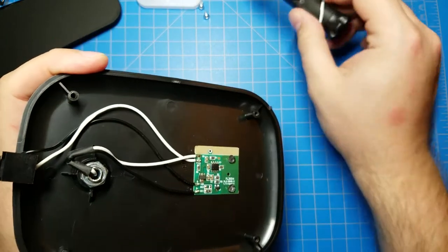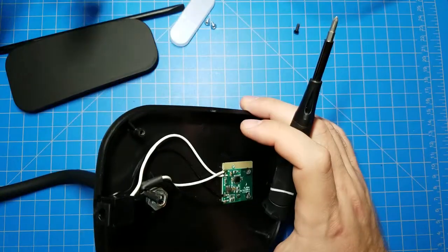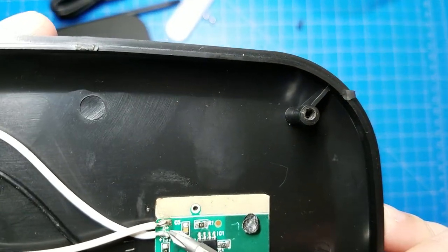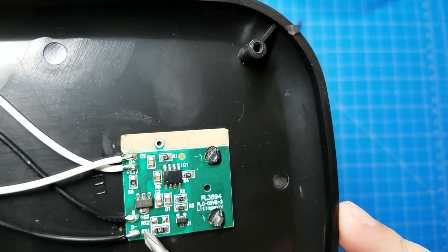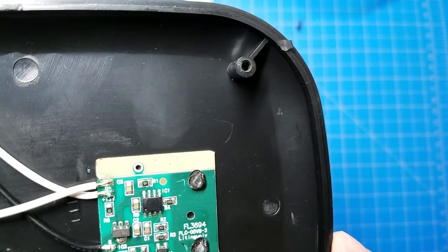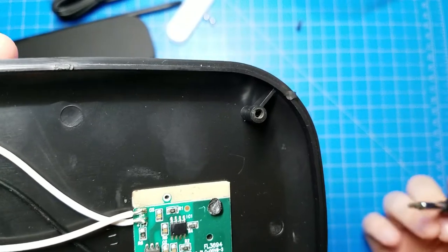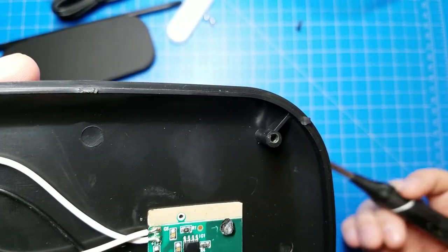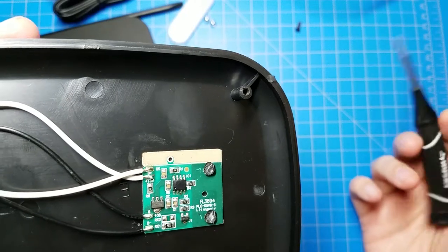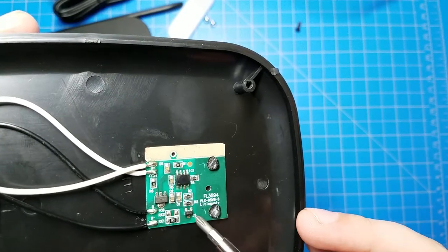We can do some maths. We have 13.2 volts coming in across a... Nope, that's right, because it's going right out. Comes back across this 5.1 ohm resistor. I believe there's a voltage drop through the transistor to ground. So let's say 3 volts per LED, like I was talking about earlier, 12 volts plus whatever the voltage drop is going to be across that transistor, which isn't going to be much. Let's ignore that, because I'm not sure if there's a voltage drop across that transistor.